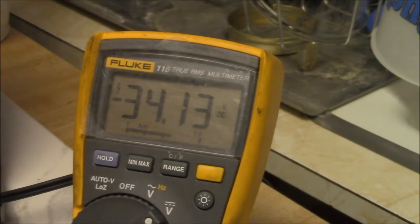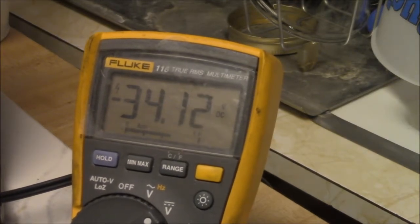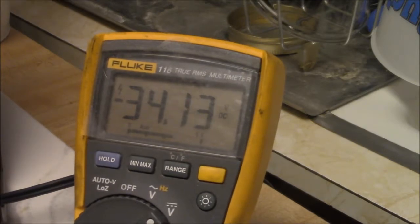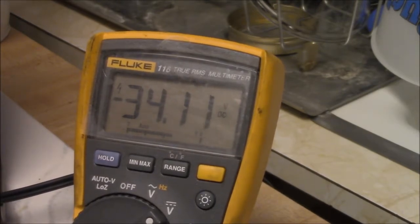is the DC bias is really low on this. The negative bias ought to be probably about 42 volts. It's letting the tube run a little warm. But I've actually got the Variac turned down a little bit, so it's not. But it's trying to slightly, just in the corners, red plate the thing a little bit. It's running a little warm.